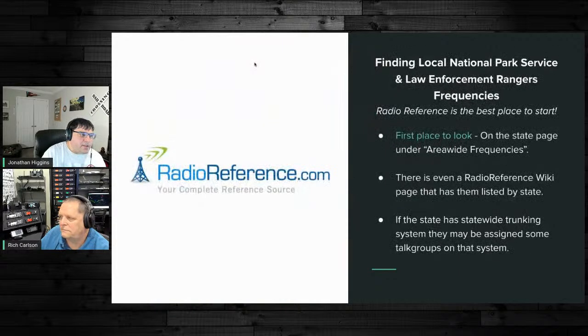So let me go to our next slide, and of course, Radio Reference, our best source for local, national. Do you see a pattern going on here? Yes. Anything frequency-wise, the first place you look is Radio Reference. Right. So for any of the national parks or law enforcement ranger frequencies, Radio Reference is the best place to look. First place to look is on the state page under area-wide frequencies. The state page for a lot of these larger systems is the best place to look. There's even a wiki on Radio Reference that lists all the national parks and frequencies by state. So that's another tool you can use.